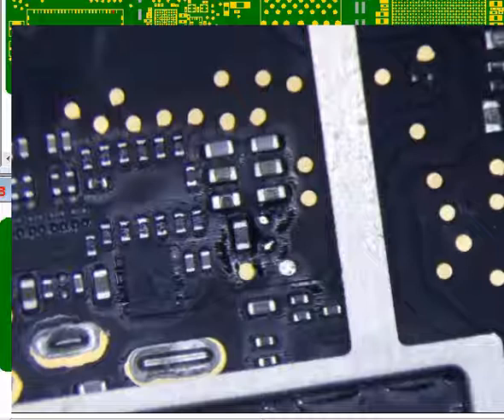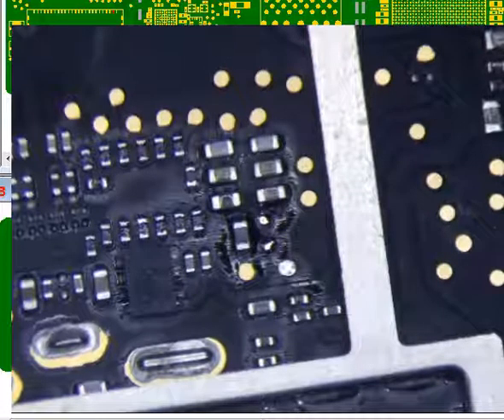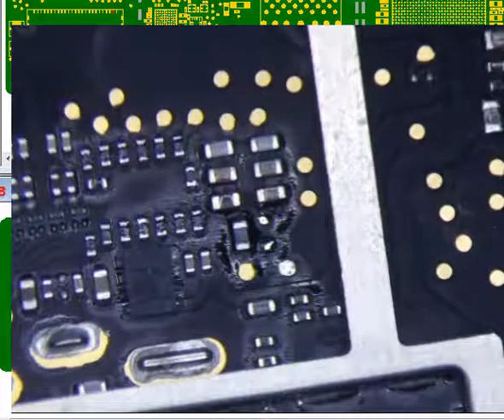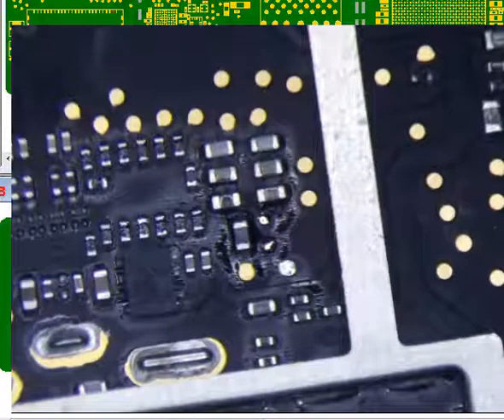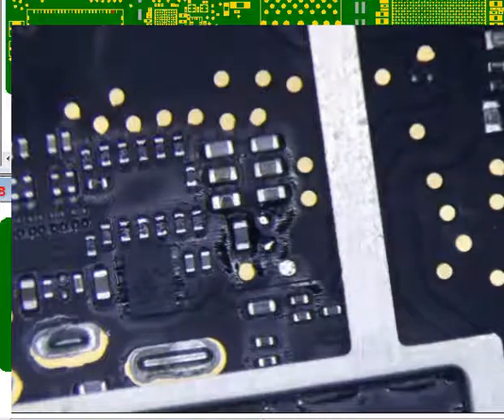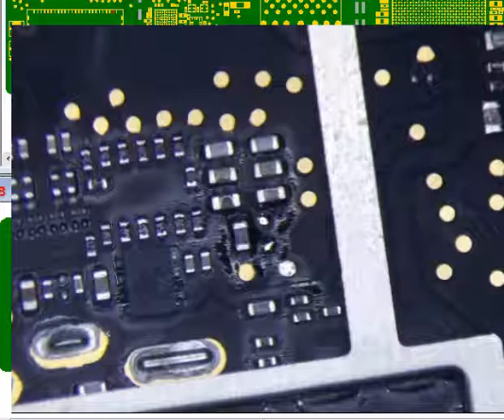I have my part here. I get them from — well, not all of them. I use donor boards as well, but a lot of them are from Digikey. Looking at the schematic, it's a 240 ohm inductor, rated at 300 milliamps. And it's a 0402 package.